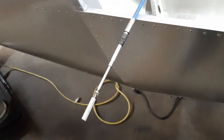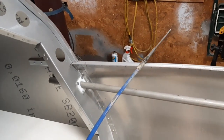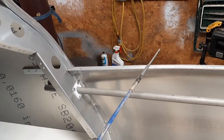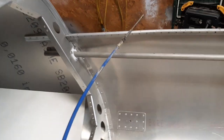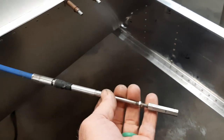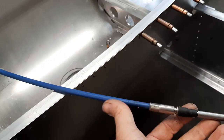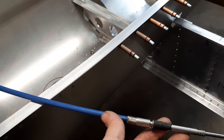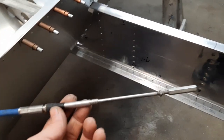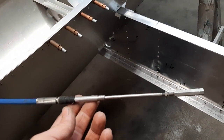The other thing the Minimax used was what are called push-pull cables. Here's a small one off a jet ski, but it's the exact same kind of cable. When you pull or push on one end, the opposite end moves in and out. You've got a control rod that comes out, hooked in here, crimped to a smaller wire that's encased in a housing. That housing has a hard plastic surface on top, braided steel underneath, and then a Teflon or plastic liner for the wire to slide in. That way you can pull and push with it, and these work really well.